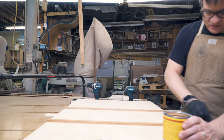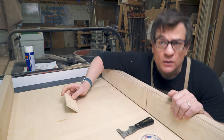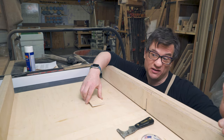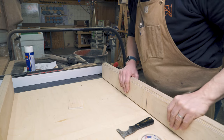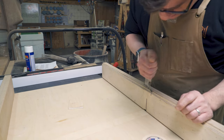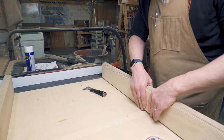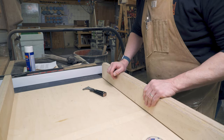A little bit of paste wax on these runners. One other thing worth noting: you also want to make a replaceable insert for the fence. I forgot to film that part. The simplest way — what I did — was add another piece onto my fence and make the insert in there. I use this sled to build furniture, for fine cuts that need to be backed up and beautiful. So you slot one of these inserts in there, put a little double-sided tape on it, and then you have a perfectly fresh start each and every time, which is awesome.